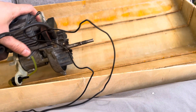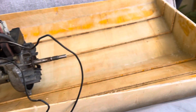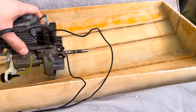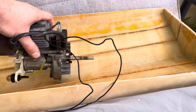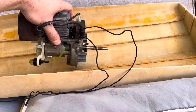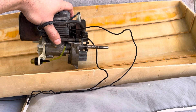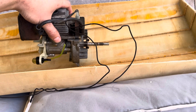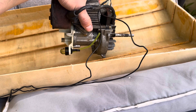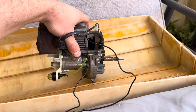Because if I'm setting it like here, which we could do, it would just mean that the machine won't be able to apply as much torque - torque will be lost through the flex shaft. So if we can have even a direct drive from a union, it would be amazing. Because again, you're reducing the torque loss and the shorter the drive, the better. So if I can even have it here, less torque will be lost through that flex shaft.